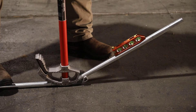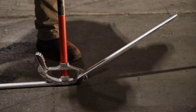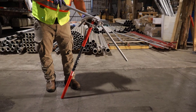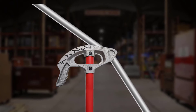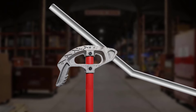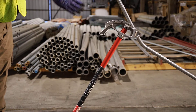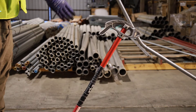To make the second bend, you actually have to pick the conduit up with the bender and stage it overhead. With the first bend complete at 30 degrees, we're going to stand it up, put a little back pressure, lift up, slide that conduit forward, spin it around 180 degrees, and line up mark B on the arrow. Here's where line of sight and your visual preference has to be in line — use the bender handle and a straight-forward look to make sure everything is in alignment as you put the second bend in.